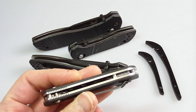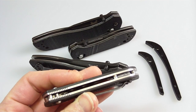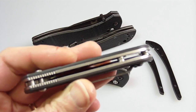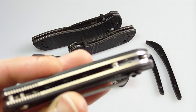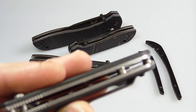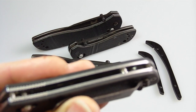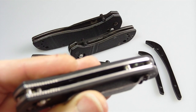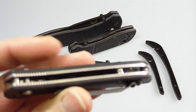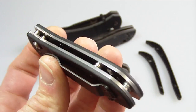For the 705 I used some .140 barrel spacers — you can see those here. They're kind of plain; they were threaded for number one screws, and the screws that go through the scales and liners on the 705 are 2-56, so I had to drill those out. That really wasn't a problem — it's a little finicky because they're so small, but it's not a hard project.